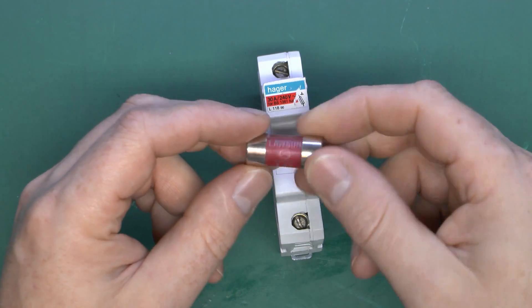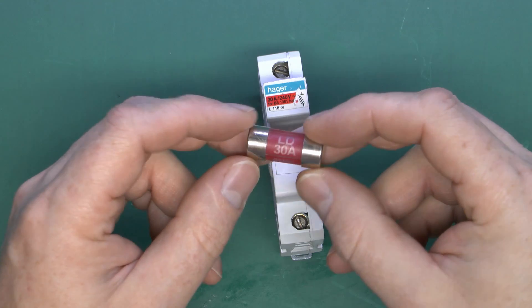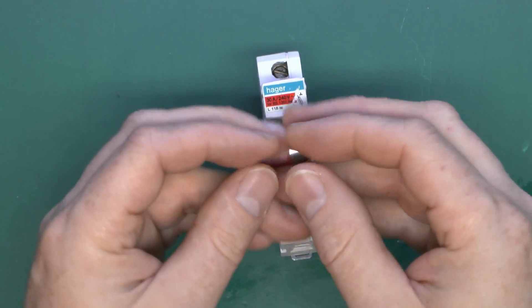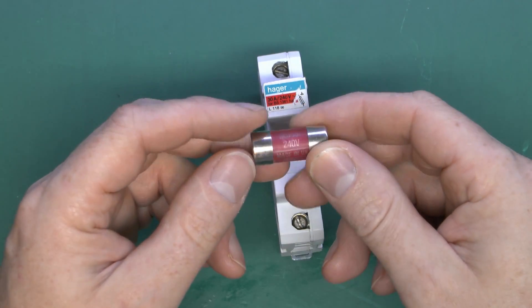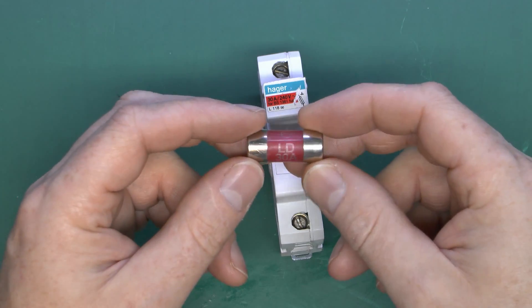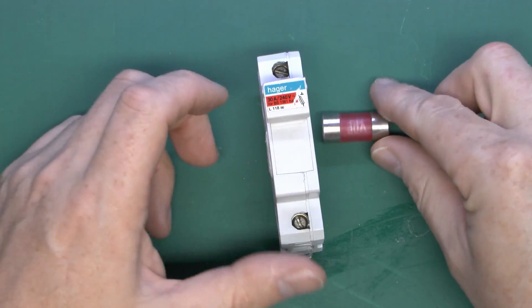This came from a shower circuit, and the shower is one of these electric ones that heats up the water as used, so it's a fairly powerful device. The shower attached to this one was an 8.5 kilowatt. And 8.5 kilowatts at 240 volts is in the order of around 35 or 36 amps. Pretty obviously, 36 is a lot more than 30.